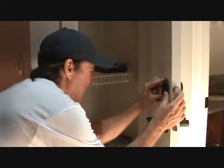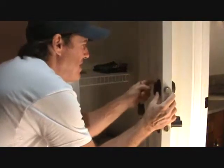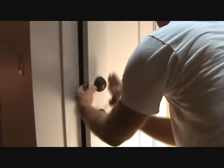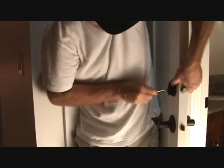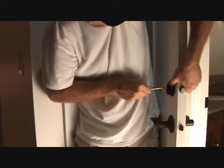I'm just going to look at that and kind of line that up. If you see a little ring around where it was on your door, you want to cover that up. My pet peeve is to make sure that the key is facing straight up and down, not at a slight angle. I'm just going to hold everything here together. Now I can tighten it up — just make it snug, and then one little extra oomph.